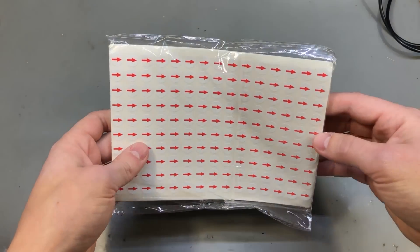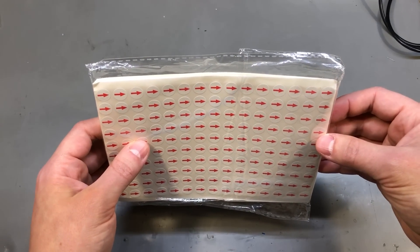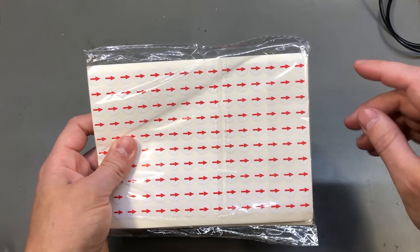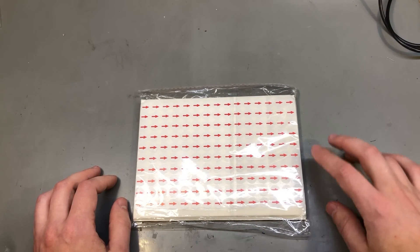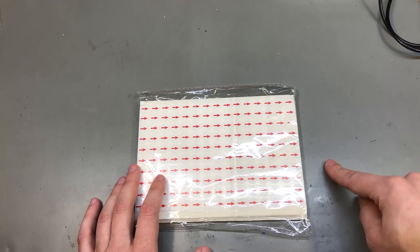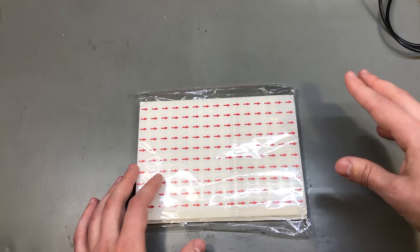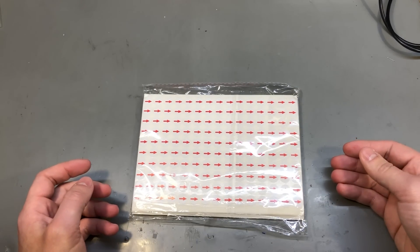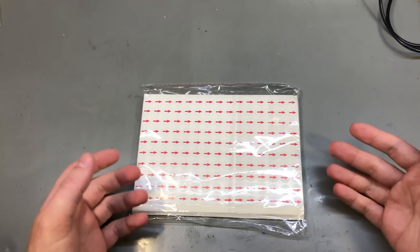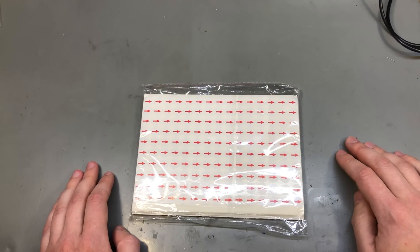Next I got myself a big lot of these small arrow stickers. I don't ever need this many, but it was the minimum order quantity. The purpose of these is to help me during small to medium board production runs. During testing, if you find a particular problem with the board, you stick one of these little arrows to pinpoint the problem, then pass it to the next operator to fix — or in my case I'll fix it myself later in the production process. You'll find a link in the description below the video.